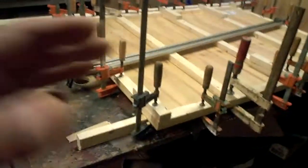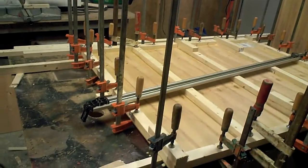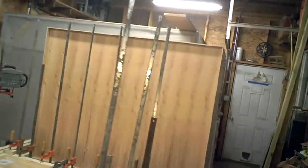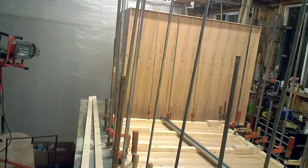By gluing everything without screws, I'm giving no place for any rust or intrusion or anything to come through. Once I encapsulate this in polyurethane — I'm going to put three coats on everything — it'll be quite the ordeal. And this isn't even going to be exposed; this will then have siding over it. The idea of the polyurethane is to completely encapsulate these insulated panels so there's never any weathering problem, even if there's some sort of leak through the siding.